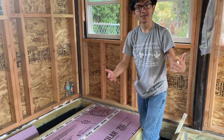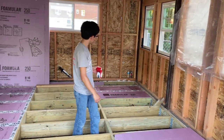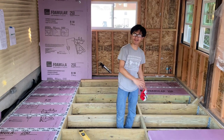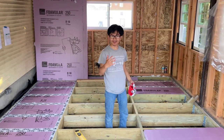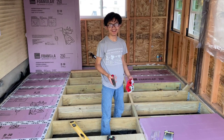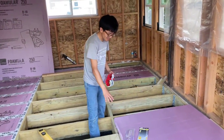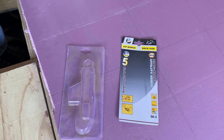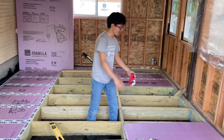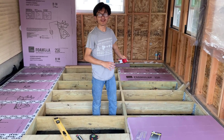Next step, if you want to use caulk then use caulk, but now we're going to put on the tape. So that was pretty much all we need to cover in this video. All you need to do is put the wooden scrap shelves, then trace out and cut the foam. Use safe knife handling — make sure when you're done you pull back the blade and put it in a safe spot. After you cut out the foam, install it by sliding it in on one side, then pushing it in on the other side. Then put caulk and tape to finally seal up what you just installed.